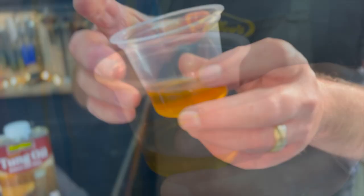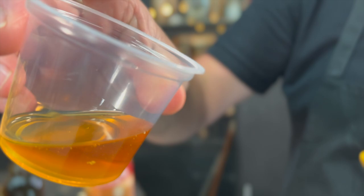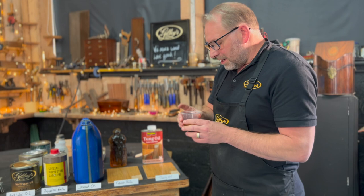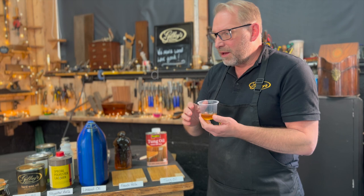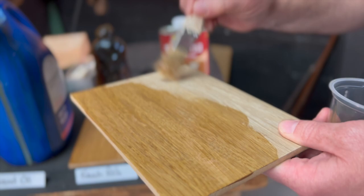Now this is linseed oil — you can see it's quite viscous. This is boiled linseed as opposed to raw linseed, so it's got a chemical dryer in there. Linseed oil has been around for a long, long time and it's the base of a lot of wood finishes, certainly paints and clear coat finishes for wood, for centuries. I'll do the same — leave it on for 20 minutes and wipe off the excess, otherwise it's going to take a long time to dry.